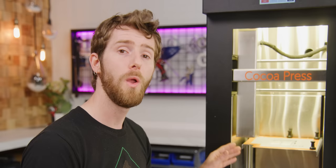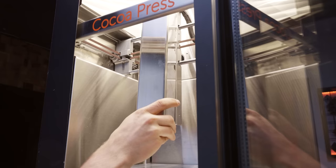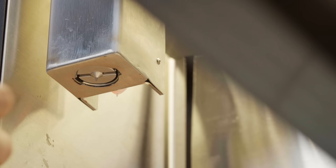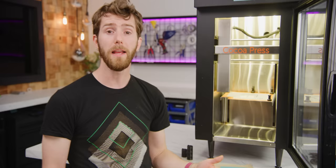Where this differs from plastic filament-fed machines is under the cover. Here we've got a stepper motor hooked up to a syringe with a stainless steel chamber wrapped in heating pads. Inside that chamber, you place these pre-tempered and shaped chocolate slugs, with the inner cylinder locking into the head on two locking lugs. There are two heater zones — one for the body and one for the nozzle. One cool note: there's nothing proprietary about the refills. You could put in icing, cheese whiz, your own chocolate, whatever you want. But for this video, we'll be sticking to the included pre-tempered chocolate, which really is delicious.